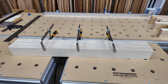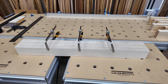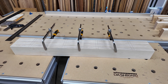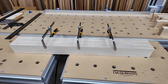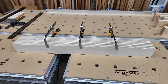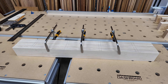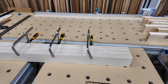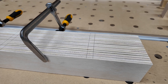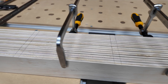Conceptually, cutting these isn't very difficult. The usual approach is to put all of the ribs together and make a gang cut, which works out to be essentially a dado — I'm thinking of it as a trench, and yes, I'm picturing a trench like the Death Star with Luke flying down it. The basic idea is that when I put all my rib boards together I've marked out where I want my trenches to go, and if I had a way of cutting this dado, everything would turn out the way I want.